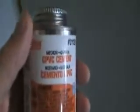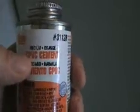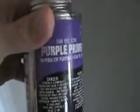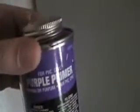Now, other thing you need is a special cement that again has a high rating for temperature. And again, you need the CPVC cement, not the normal PVC cement. And this one's going to have this orangey look. You can still use the standard primer before applying the cement, the one that is used for PVCs as well. And applying this is really simple.